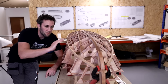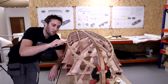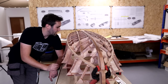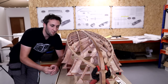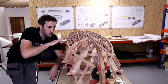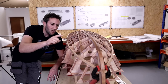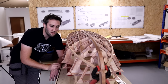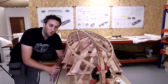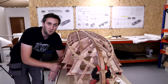The chines are all pinned in — I've got these fixed at every frame station now. What we need to do is to bevel this top face. If you remember when we were marking that out, we've got this outer corner here which is a little bit high and that's going to need to be flattened off to take the chine flat. I'm just going to do that with a little block plane. You could transpose the flat lines of the chine flats back through the chine at each station to use as guidance, but I'm just going to go at it with a block plane — it's only a fairly small bevel. We'll get it in and try the chine flat on there and see how we go.